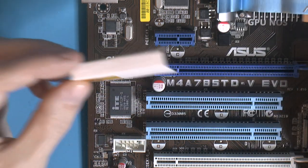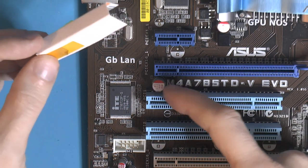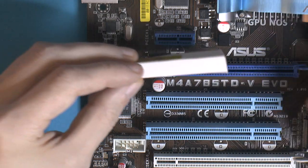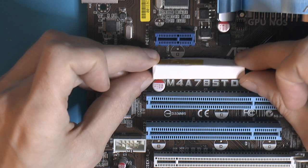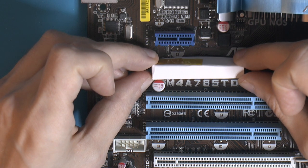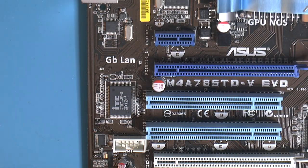And I used this before on, say, a slot like a cap like this. This is a through hole, but if you have a surface mount like that, I had a few small ones next to an AGP slot, right up to it, and this works fine. I could remove it with hot air, I can add a new one with hot air, no problem. So yeah, I found it to work quite well.